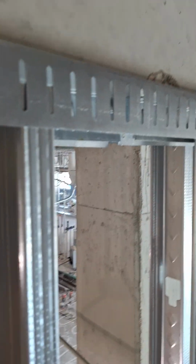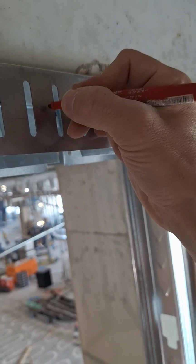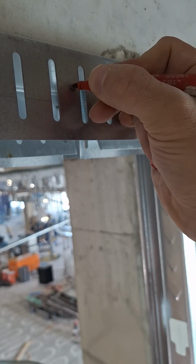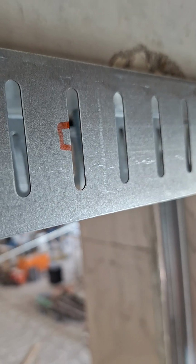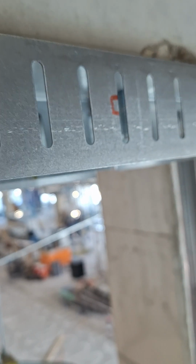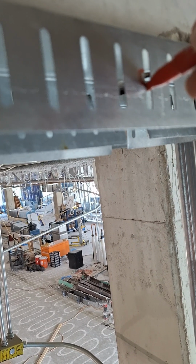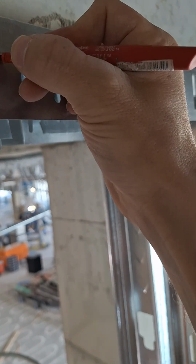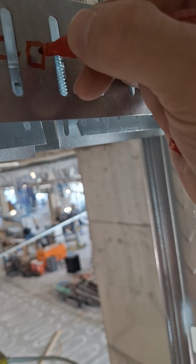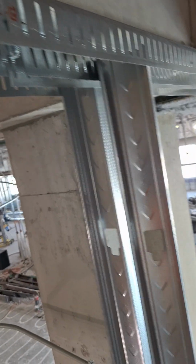Now there is a manufacturer, I rarely see it, and it's probably because it's more expensive, but all along their top track, they have in these grooves a little square washer that's barely attached, about that size right there, in between each and every one of these. So you can measure your stud to the top side, and then as it deflects, the 2 tabs holding it in place break away and it will slide up and down in the groove. That's perfect. And they look about this size, like that. And then they also have a screw hole in each one of those washers or tabs. So you measure to the top edge here, and then you put your screw into that hole. And it's dead center of this all the way, which is basically dummy proofing it.